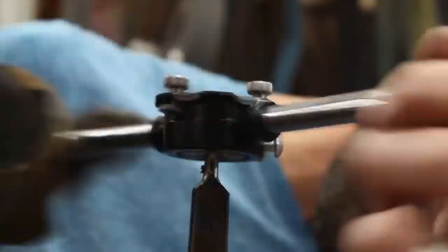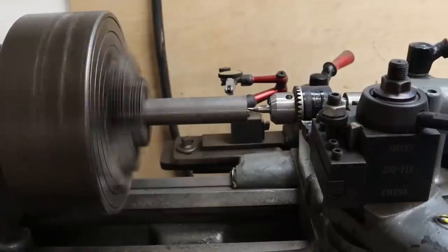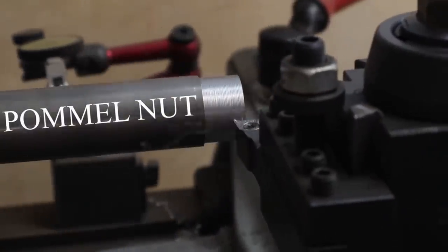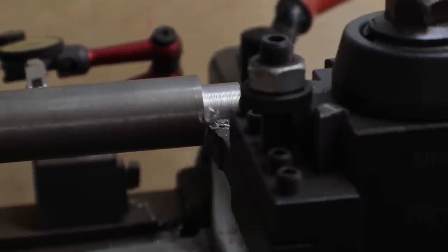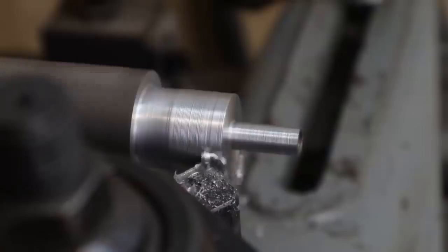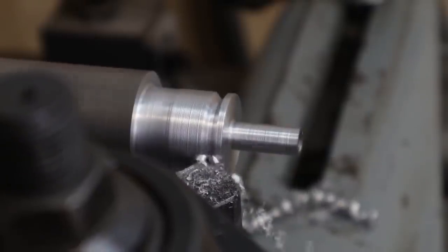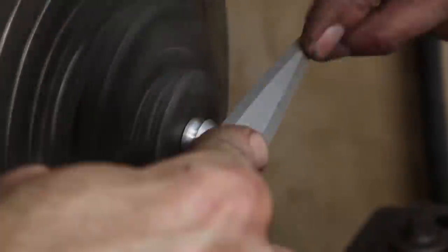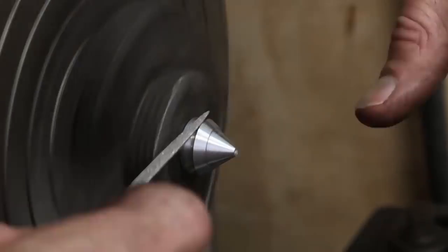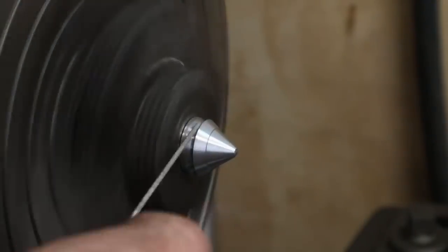I'll try to use a standard thread pitch for this. When making the pommel nut, I'm going to drill a hole first and tap it for the tang of the sword. After the tapping process goes smoothly, I'll go ahead and further shape the pommel nut. This is possible to do without a lathe — you can do it on a drill press with some files. I'm not going to get too fancy with this pommel nut, but it is really nice to have a lathe for this sort of work. Go ahead and part your piece off, flip it around, clean it up with files, polish it with sandpaper, and let the lathe do all the work. Work smarter, not harder.